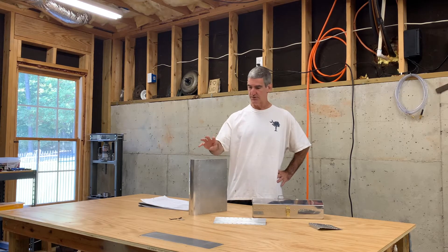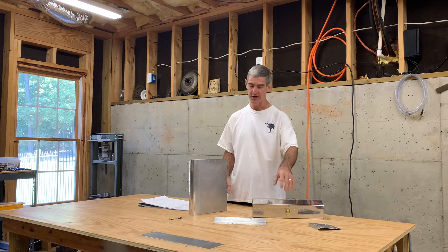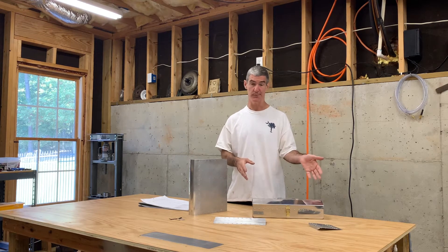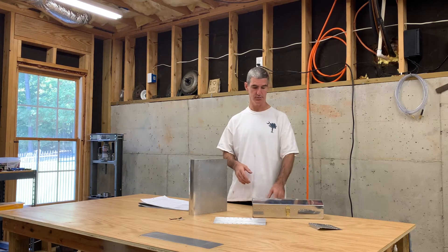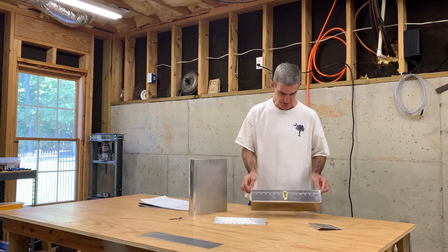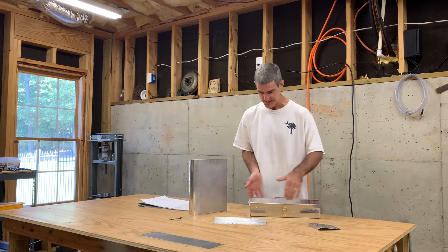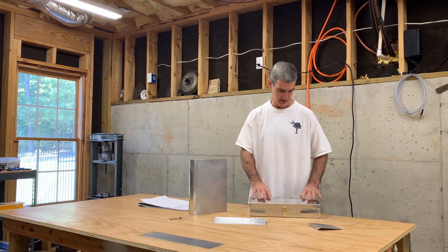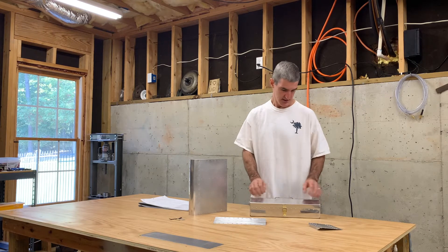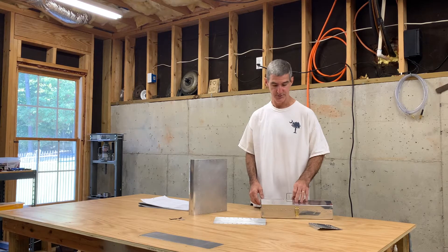There's a minimal set of tools you can buy that is not nearly as expensive as buying the pneumatic squeezer and pneumatic drill. Some people don't even buy those at all. But I wanted to go ahead and get as much of the real tools I intended to use, so I would get practice using those tools on the practice kits. In terms of what comes with the toolbox kit, it's about a one-page front-and-back plan, all the bent parts — sides, bottom, top, hinge, hardware, and a bunch of different sizes of rivets.